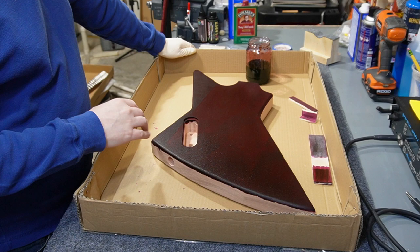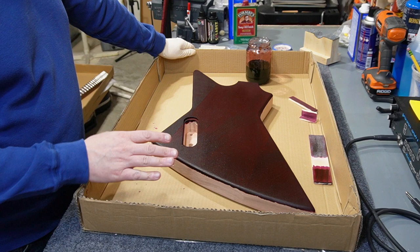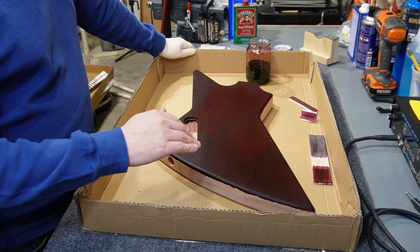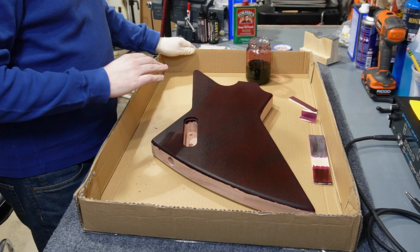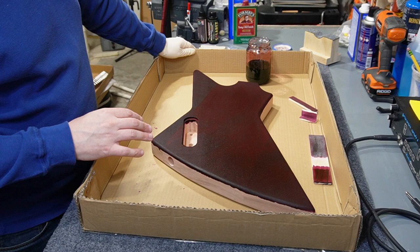Okay, well this is the back - it's still not dry yet so it's a little bit dark; it will dry a little bit lighter than this. It did seem to raise the grain just a little bit. I don't know if that will recede back but it's not a big deal for what I'm doing here. If you were doing a completely gloss mirror-shiny finish, you would actually want to raise the grain and sand before applying the dye. I'll let this dry before I try to flip it over and address the back.